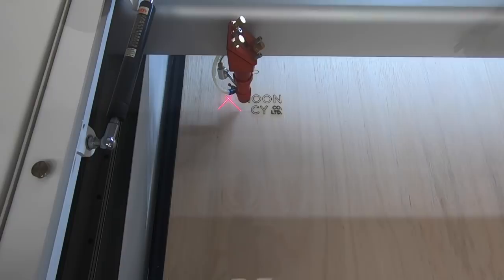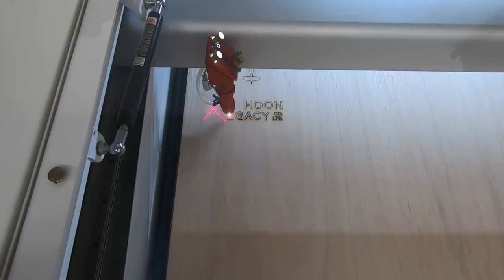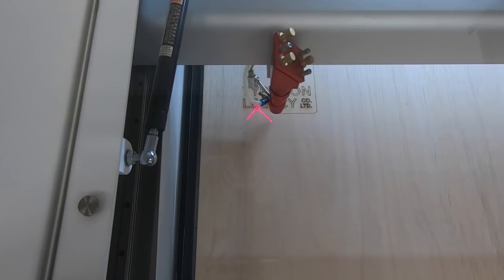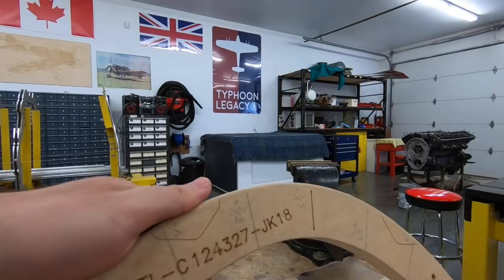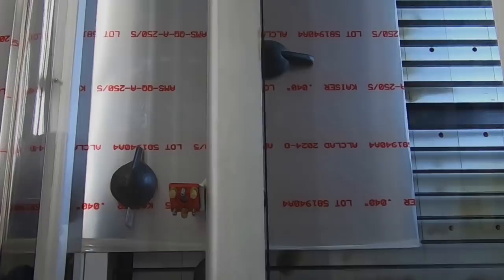One of the big time savings we see with the CAD work done so far is on lofting and layout, and it applies to both of our form blocks. Even though they're manually cut, we use the laser to mark everything with part numbers, datum lines, and stringer cutouts just for reference. It gives us our centers for tooling holes, and then we've got another laser-lofted chart that we can lay the form blocks on, identify the angles at different points, and then manually cut them. It's used for the form blocks and also for our flat pattern.